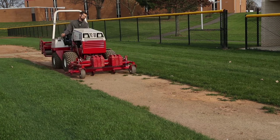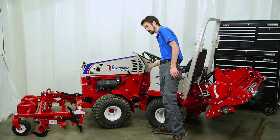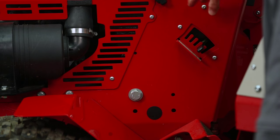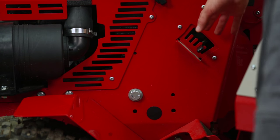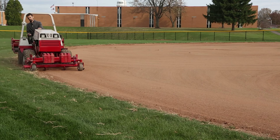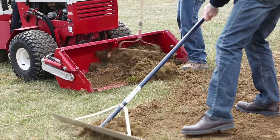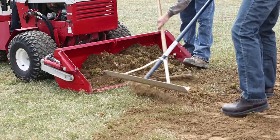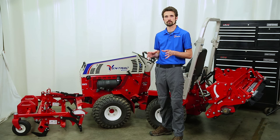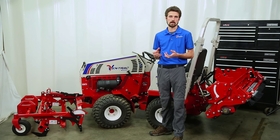When doing weed management and cutting edge lines, a few tips: if you can have the tractor in low range, that is preferred. Also, weight transfer can vary a little bit — you can have it off, or on a little bit if you have weights on the front. As you're cutting out weeds, if you can have someone raking them away or rake them yourself, do that before the next grooming step. Most weeds, if you have small stragglers in your field and you cut them out, they will lay on the surface after grooming and will just dry up and blow away.